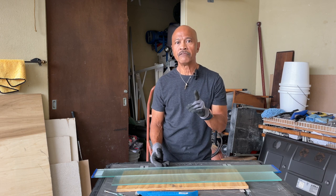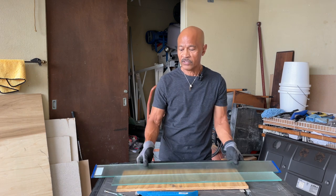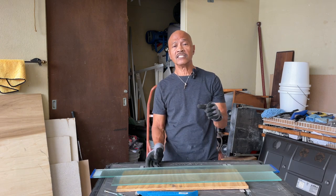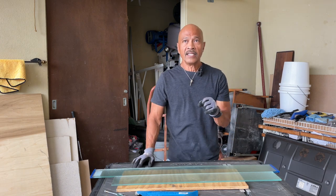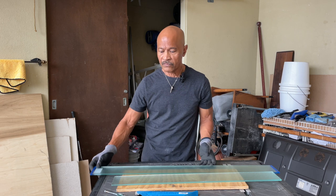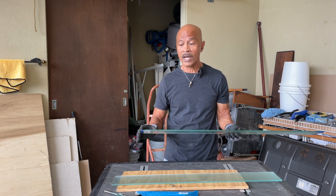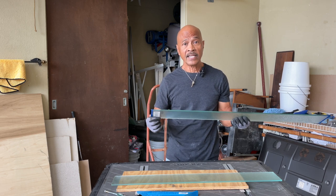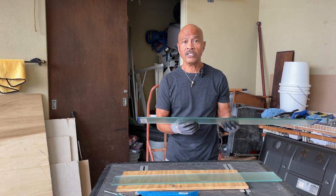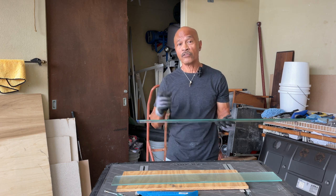Keep in mind one important factor: say if you have a 34-inch length that you need cut, to replace the broken one you would want to buy one that is at least 36 inches. This is the guide. Anything under an inch and a half will be hard to cut. So if it's a 34 inch that you need, you need at least an inch and a half or more to actually snap this glass in place. Anything less, when you try and snap them, it'll crack. So that's important information you need. Again, if it's 34 inches, get a 36. If it's 30 inches, get a 34.